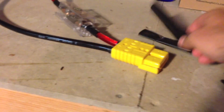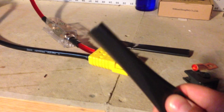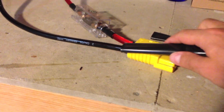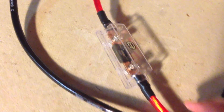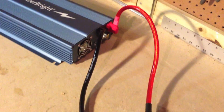You'll want to put some heat shrink rubber around the connections. You seal your connections up, get your blowtorch out — it might work with a blow dryer, but I use a blowtorch — and it makes a nice professional-looking job. Nothing is hacked here. You don't want to mess with a $30,000–$40,000 Prius and risk any electrical sparks.